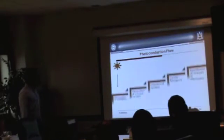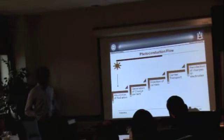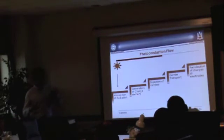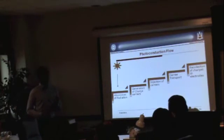So what exactly happens in a photoconductor, or in this organic solar cell? Once sunlight falls onto that, we have absorption of radiation. That's one of the factors. It absorbs as much radiation as falls onto it. The next step is generation: the light photon energy breaks the bonds and generates the charge carriers. Those are called excitons, or the hole and electron pair.